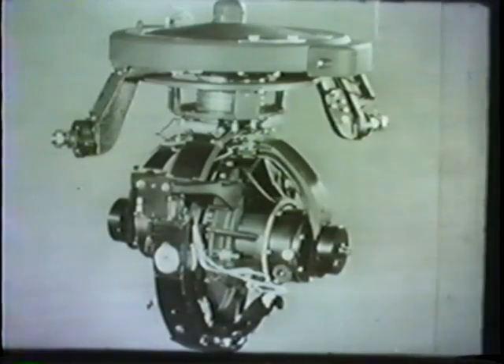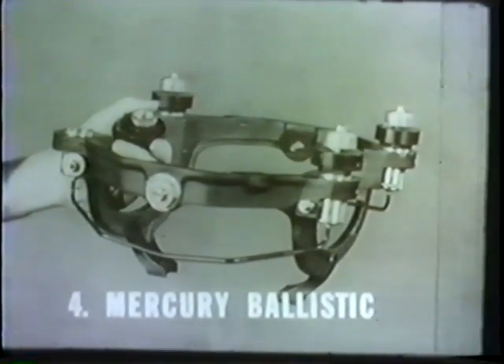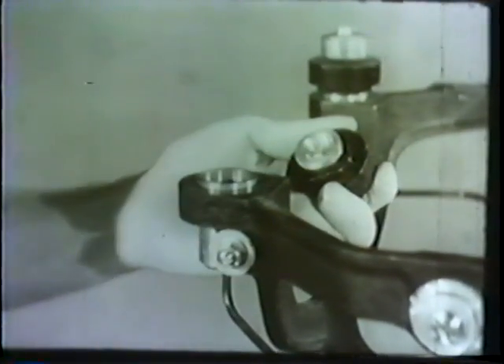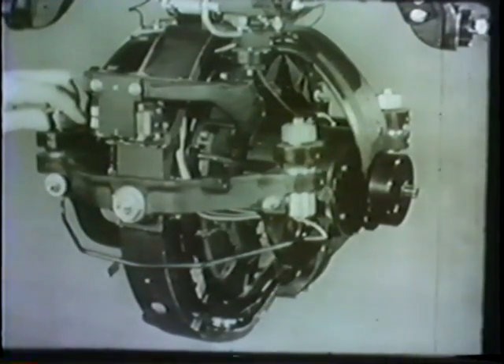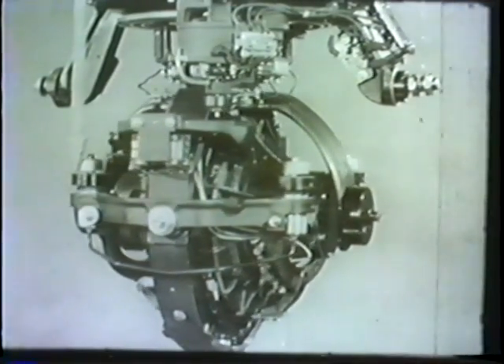To complete the compass, there are two more major assemblies. The Mercury Ballistic, our fourth major assembly, has two pairs of Mercury tanks — one pair on the east side and one pair on the west side. The tanks of each pair are connected by a tube of small diameter through which the Mercury can freely flow as the ballistic is tilted about the horizontal studs. These studs fit into bearings on the phantom. In order to serve its purpose of causing the rotor to precess, it must be connected to the rotor case. This is accomplished by means of a connecting link which fits over the offset bearing on the bottom of the rotor case. Now, if one side of the ballistic is heavier, the force of gravity will try to tilt the rotor, causing it to precess, bringing into operation those principles which make the gyroscope a compass.